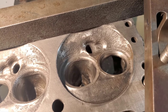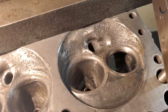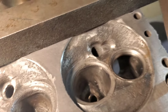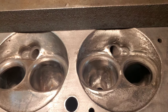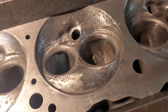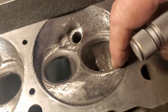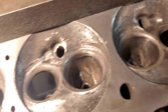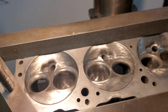Hello, I'm working on our little red express heads. You can see these castings were very rough originally from Mopar — that's just the way a lot of them were. Mopar Joe did the porting and finishing, and of course the seats had a lot of water damage. We're going to fix this — we're going to cut this out, put seats in, and we're getting set up to put in some guides.